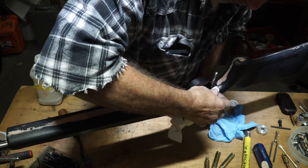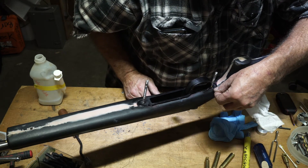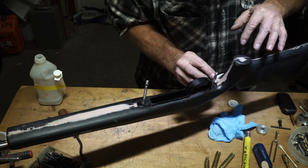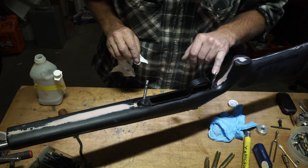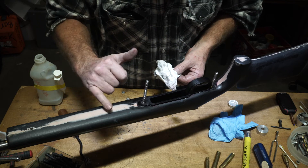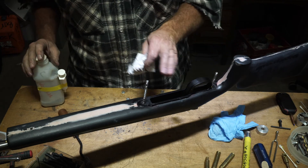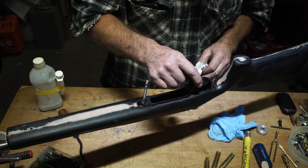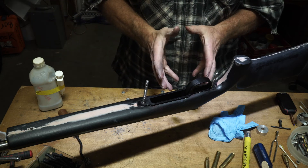Anybody who's ever done body work, be it on a car or on a stock, realizes that prep work is everything — that going back and cleaning up hardened epoxy is always a pain in the butt. The guy who had this stock before me had done some work cleaning and buffing it out. There we go — all we've done here is pre-bedded this in, got the alignment, got the depth, got the placement that we wanted. Now I'm going to let this harden up tonight.